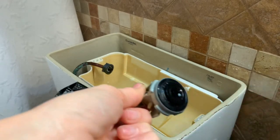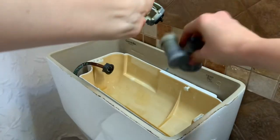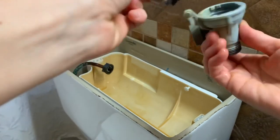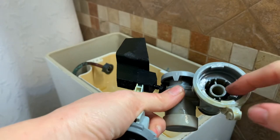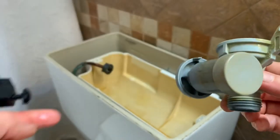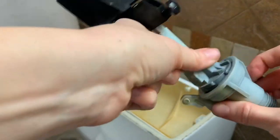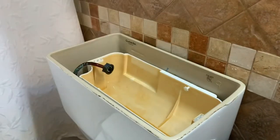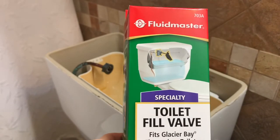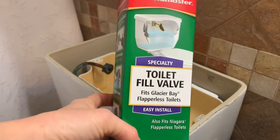This broken piece is what I think is causing the issue of the water going so slow and going out the wrong part. Because once that piece broke, it's no longer cutting the water off and keeping it out of this section. When the water gets stopped, it forces it to go under here, into this part. And once this little tank fills up, it all comes out of these little holes underneath. That disc I was calling the diaphragm is actually called a disc shut-off seal. So I ordered the toilet valve replacement from Fluid Master online, since my local hardware stores didn't have one in stock.